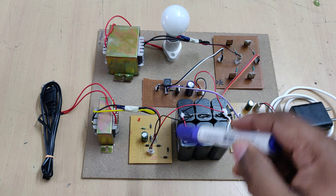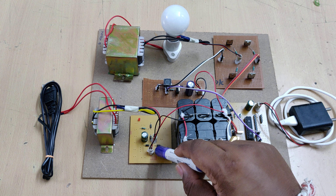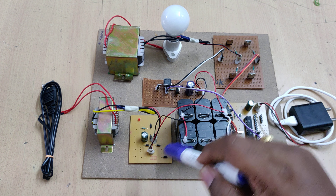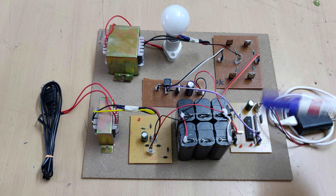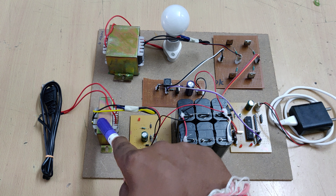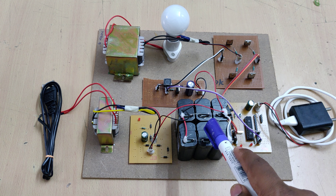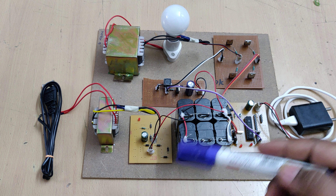The reason we are using this single inductor buck-boost converter is that we are providing this voltage to this battery. If there are any power fluctuations and we want to maintain maximum current — since we are providing 230 volts input and the transformer output is 12 volts AC — when charging a battery at low voltage there is a chance of harmonics being generated.